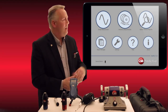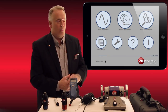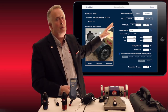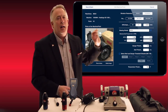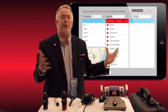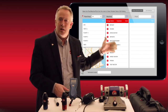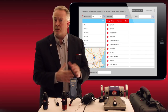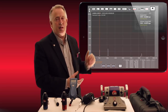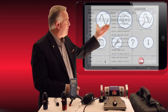Going back to the main panel, we have three different sections: single measurement mode, route mode, and viewer. In route mode, it's very simple — it opens up the route, and if I click to edit the route, I can put in all my bearing numbers, my RPM, and everything I'm going to save in that route, all built right from the iPad. Not only can we build the route from the iPad, we can duplicate machines of the same type, so if we've got 50 pumps in a row we don't have to set up each asset point separately — we can copy 50 of those into our hierarchy very quickly. It's one of the fastest route builders we've built to date.